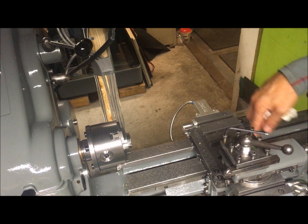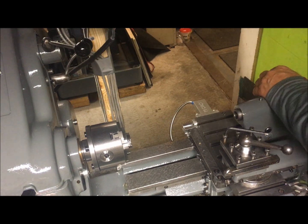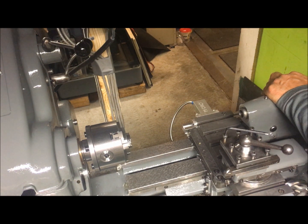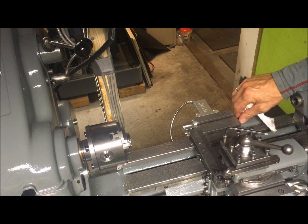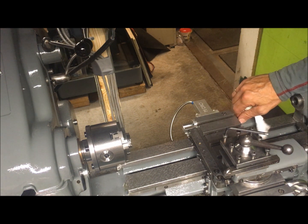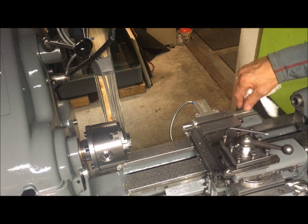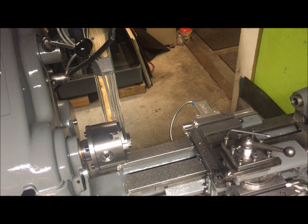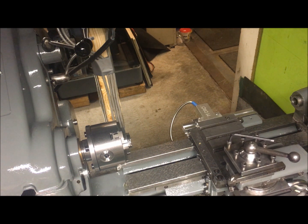This leaves the sides here totally free, meaning you have no problem when you want to go up to the cross slide with the tail stock. It also retains the screw here — if you do it another way you need to modify this screw, but this does away with that need. Mounted to the snug side, it's now very even and in no way binds up or causes trouble.